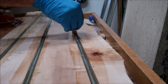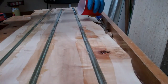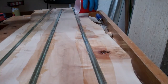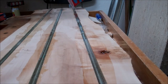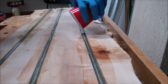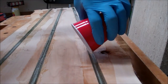I don't really like that because in the finishing process I end up sanding all this. If I sand the surface of the epoxy, I can sand it to a bright sheen and a polish if I want, or just sand it to a dull finish. It blends in better when I sand the surface of the epoxy. But if I underfill it and go even with the wood so that when it dries and shrinks it's concave, I never really get that concave surface into the sander, and I'm left having to accept whatever the surface of the epoxy was. Sometimes that's fine, sometimes it's not.